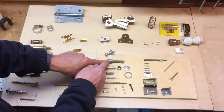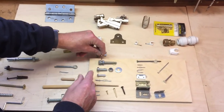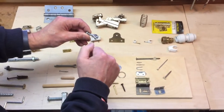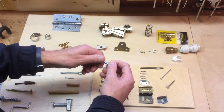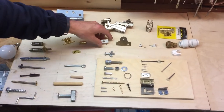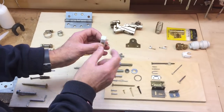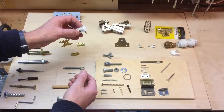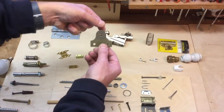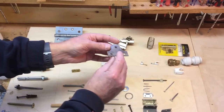If you haven't got a locking nylon nut, you can use a locking washer with a serrated edge, though these are more old-fashioned now. Wing nuts you can undo by hand — great for situations where you need to undo something easily, making them semi-permanent. For kitchen construction, plastic blocks are used where you screw in one end and the other for a quick fixing between two pieces — good for cheaper cabinet work. Brass picture and clock hangers are put on the back of things to hold them up — brass won't rust or mark the wall.